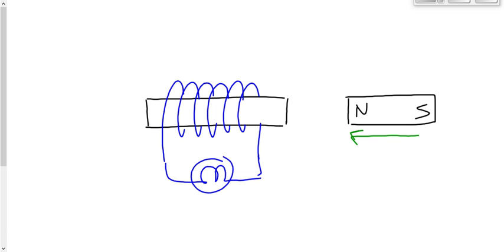That concept comes a little bit later on, but I want to use what we've just learned as part of it. When I move this nearby, the magnetic field produced in the coil will always act to oppose that motion. So this end becomes north. When I push a magnet nearby this coil, I produce a magnet right here — it becomes north to oppose that motion. If it became south, it would attract rather than oppose. If this becomes north, I want to know which way the current goes through that light bulb. Give you a second to figure that out.